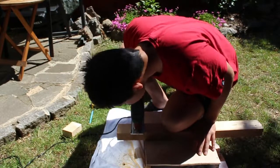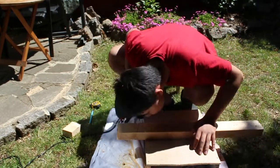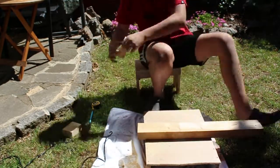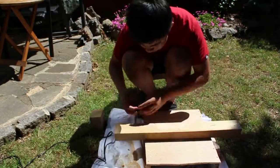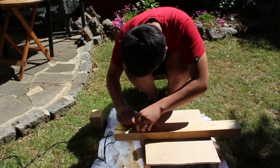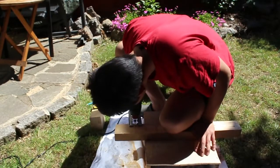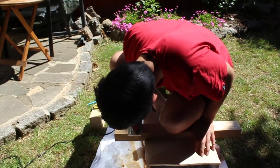What I'm doing here is I'm cutting pieces of wood that are two inches thick and four inches tall, and I'm going to place them on the side and drill them together with screws. I'm going to lay that as my foundation, and then I'm going to do the skinny on top of them.